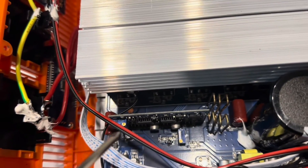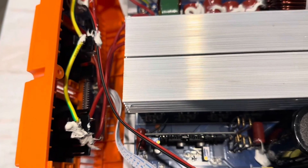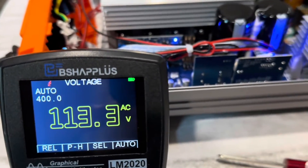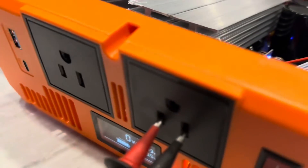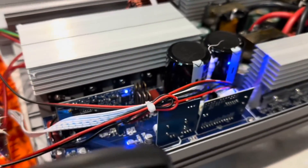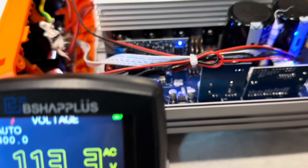So I'm going to hook up the meter, power everything up, and then show you adjusting this screw and show the voltage come up on this inverter. Just to show you where I'm starting from — remember from the other video, it puts out about 113 volts stock. You can see right here the meter reads 113. Let me get a tripod set up and I'll try to show you the voltage coming up as I adjust it.